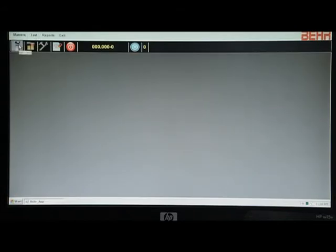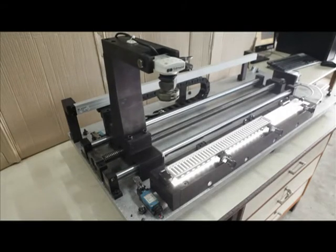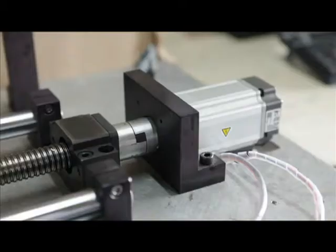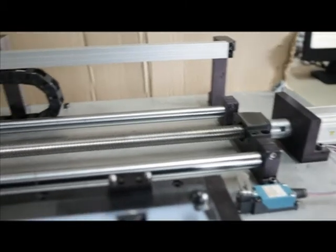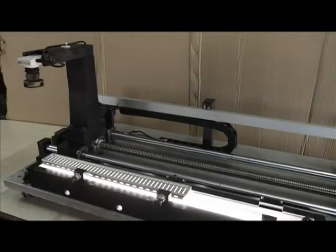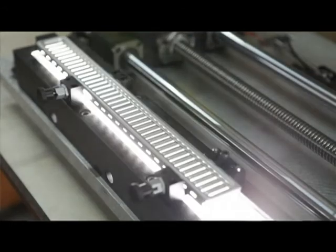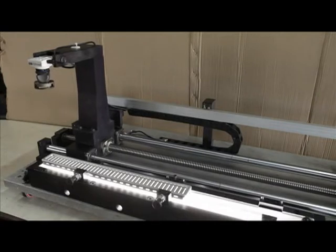The system is designed to measure dimensions of the header or component of 40mm width and 410 to 640mm length. The system consists of a servo motor coupled with a ball screw to achieve linear motion. The 10-megapixel camera is mounted on an arm fixed to the ball screw. The component is kept on a stationary fixture consisting of a diffused LED backlight and component resting mechanism.